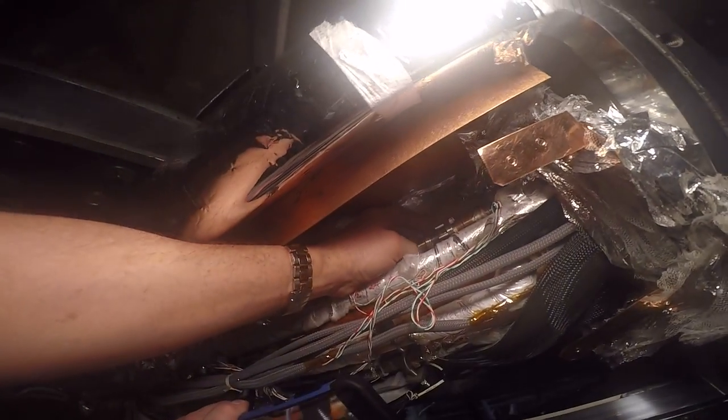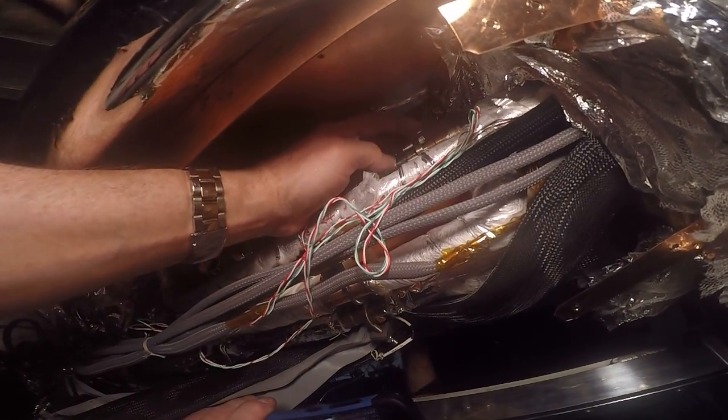Now what I did was I made these straight through. These are silver coated screws, so they really are anti-galling. It's a fully rotating flange on both sides because you need that to catch them all and then finally tighten it. Gotcha. And I'm glad I did that because I was able to do it with just a regular Allen wrench. Okay, good. Glad you're narrating. That's good.